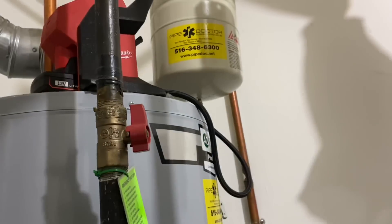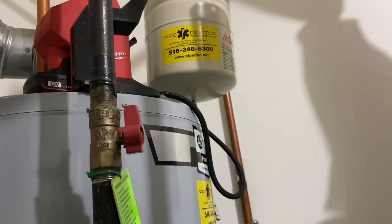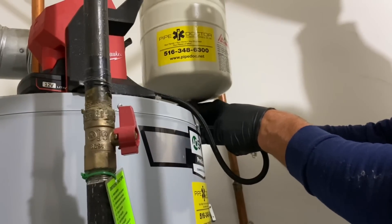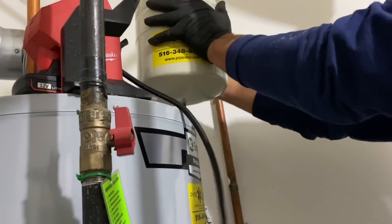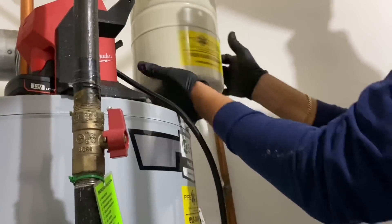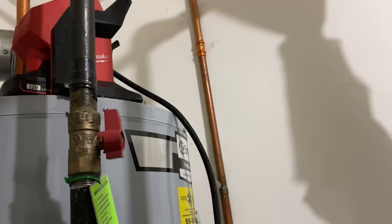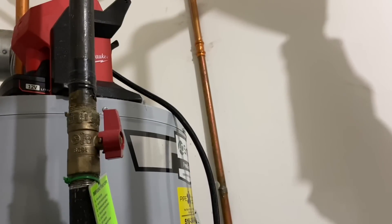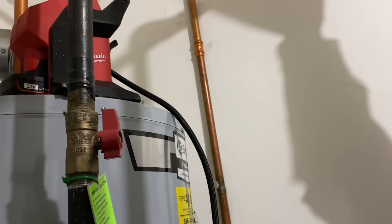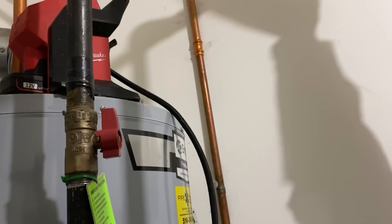Just about done pumping it down. I'm going to close the valve on the bottom of the water heater and take this off. Still got some water there. I'm going to spin this off just like that. All right, let's put this here. Now let's see if I can get that new tank in there. Let's see — you'll fit in there. There's some Teflon tape.